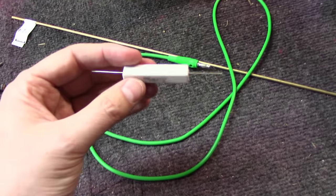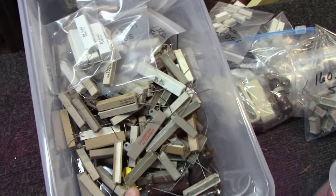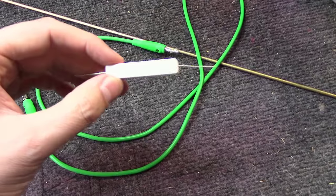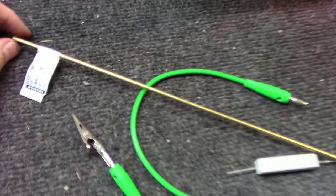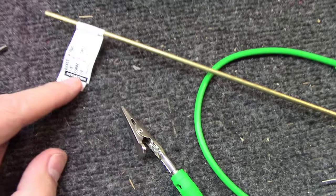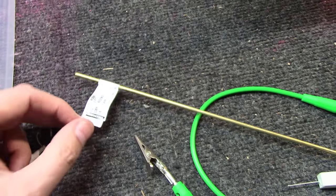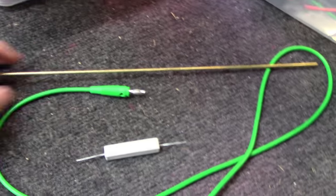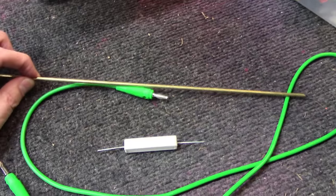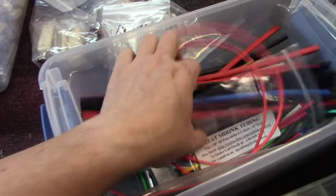75 ohm, 100, 120 ohm — something in that range. I just happen to have a nice little 120 ohm 10-watt power resistor. We're going to put the 120 ohm resistor on it. I went to Lowe's and bought a one-eighth inch, three-foot long copper or brass rod — it was $3.90 some cents. Out of this I'm going to cut it twelve inches long. You could theoretically make three of these out of one rod. The only other thing you need is a bunch of heat shrink tubing.